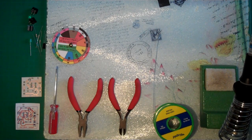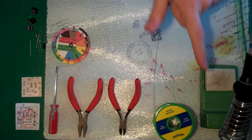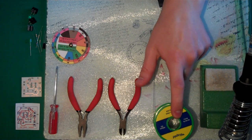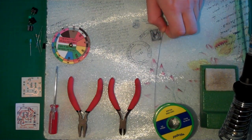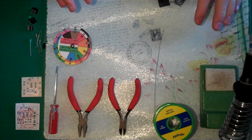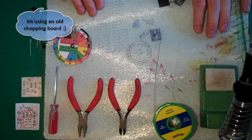Hey YouTube and welcome to part 8 of how to design, develop and manufacture a printed circuit board. In this video we're going to be looking at soldering the components onto the PCB. For this we'll need a soldering iron — I'm using a temperature controlled soldering iron at about 320 degrees C — a soldering stand, a damp sponge to clean the iron, some solder — I'm using lead free solder — some side cutters, a small pair of pliers, a screwdriver and a glass board to solder on so that you don't burn anything.